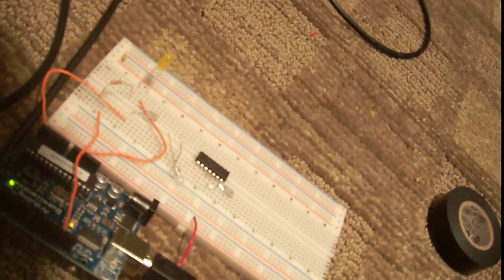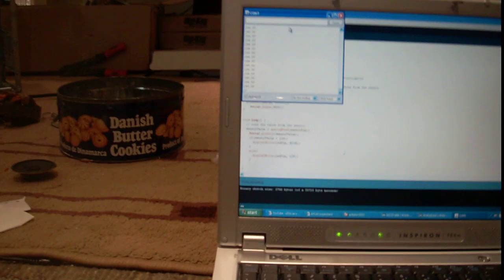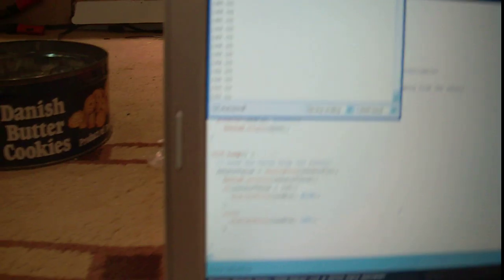So I'm going to show you how I did that. What happens is that when LEDs — you hook them up normally, right, with a positive power supply and then go to ground, they produce light. But if you hook up negative to ground and the positive to an analog input, if you give them light, they produce voltage. Right now it's going about 143 on the analog input. I'm at 144 with light. When I cover the sensor, now it's about 107. It depends on how much I'm covering it — right now with my head just making a shadow it's at 117, and now with my head right over it, the light does turn on. It's now at about 107.